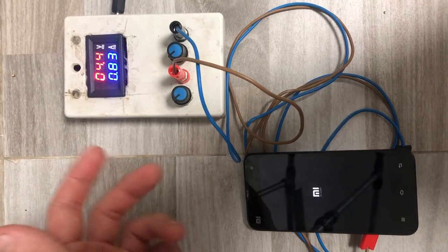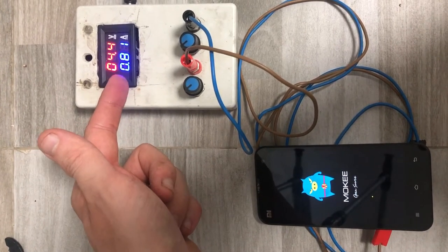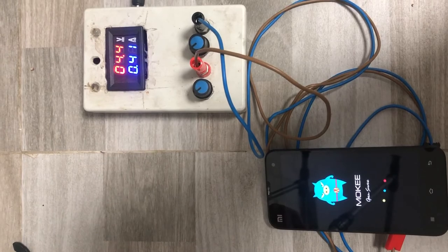There may not be enough power to power up the device. You have to use either a very powerful power supply instead of the battery, or simply use another battery. The battery may no longer work, or the charging module may be faulty. It could also be charging overnight without starting, or stuck in a boot loop — and the most common reason is that the battery cannot deliver a decent amount of amperage.